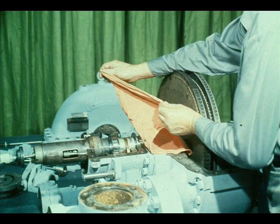Now the outboard bearing on the turbine is a different story. After replacing the bearing liner, he leaves the bearing cap off. This is necessary because the governor hood on this particular turbine cannot be installed when the outboard bearing cap is in place. A cloth is placed over the open bearing housing to protect it from dirt until the cap is replaced later in the reassembly process.